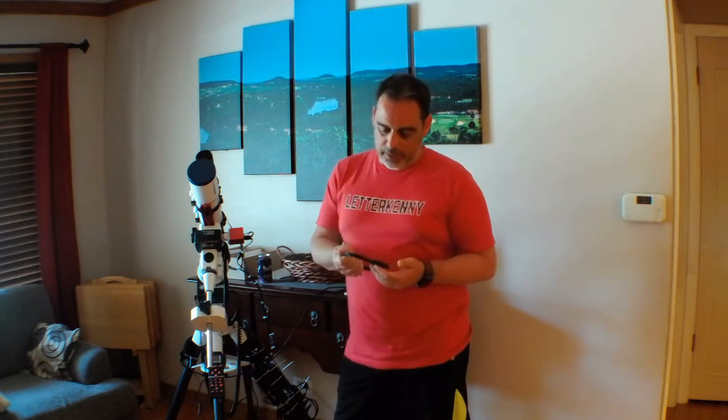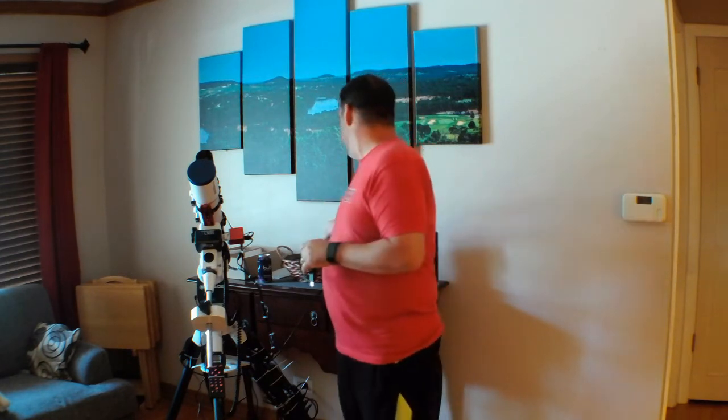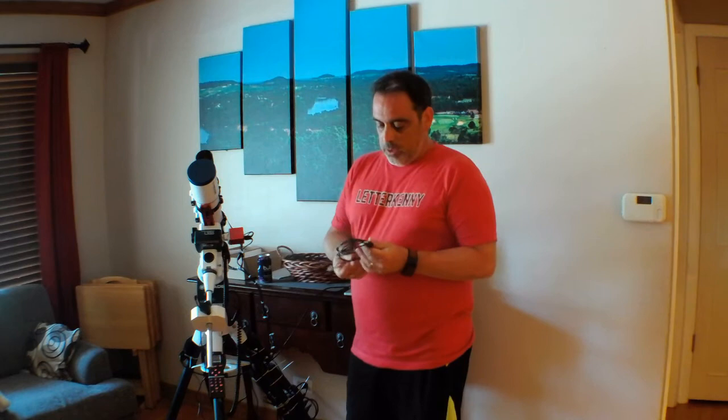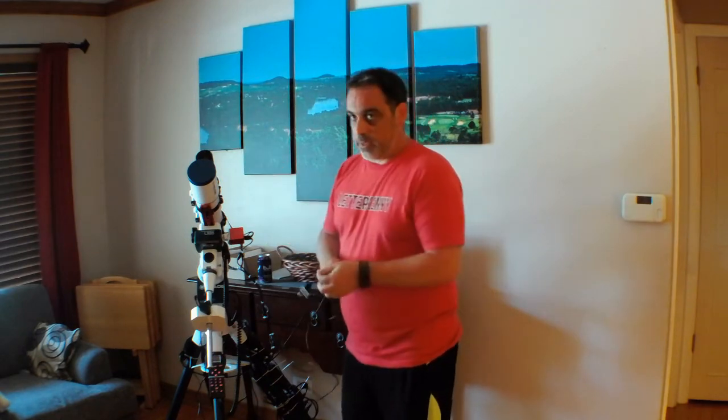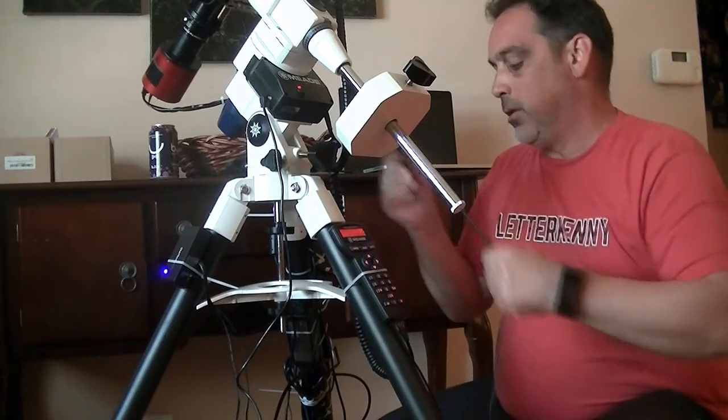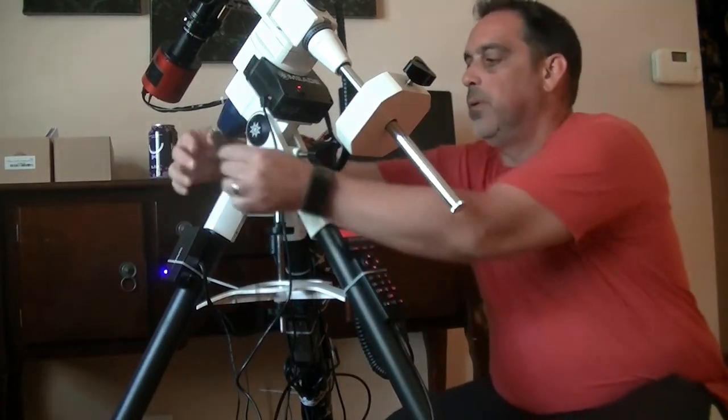Okay, so I'm setting up another scope and mount setup for my daughter, and I was looking for a Meade 505 cable and came across a direct to USB on Amazon. It looks like it should work. Actually, I tested it, and it does work. It eliminates the need for the serial adapter and then a DB9 to USB. It just goes direct from the hand controller into the USB. So I will just show you that it works. It's from a company called Washinglee, and I'll put a link in the description to the cable.